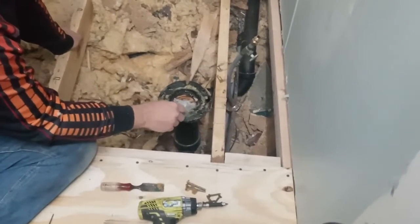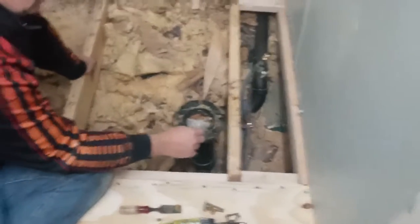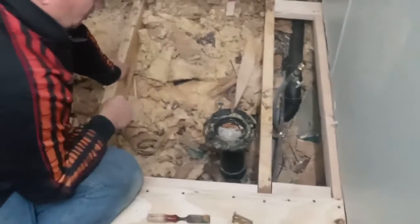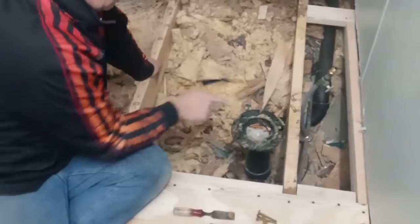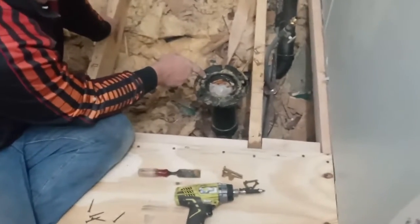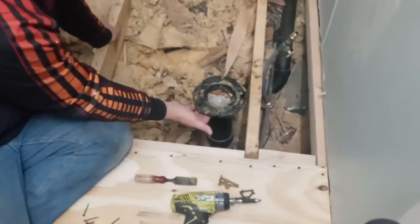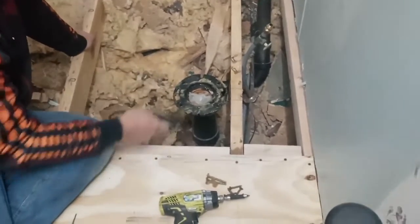If you don't, it'll have a tendency, it won't always, to break if you get anywhere close to this edge, so it'll break the flange even more, particularly if it's an old weathered flange. So what I was going to show you is, if you look in here, this sloped right there, so you wouldn't want to get your width on that all the way out to this edge, because if you feel under here, there's a slope, and it literally comes up to about right there.